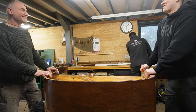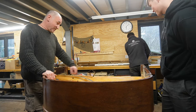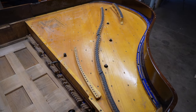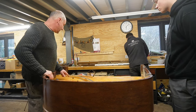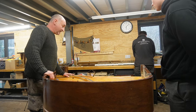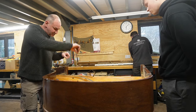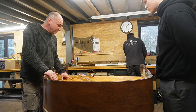How are you doing, Matt? Yeah, good. Nice to have you — thanks for inviting me down. No problem. Before you start playing, I'll just show you a bit about what we do. Yes, please. We've got a Bluthner in at the moment, a Bechstein over there, and a Steinway on its side there. All at sort of different stages, but basically what's happened here — the frame's come out, and we're just sorting out the soundboard. The rest plank is situated there under the frame, and that will be made to pattern and fit it. And then this soundboard will be routed out and shims set in on the splits that you can see, to make it nice and uniform and fix it up.